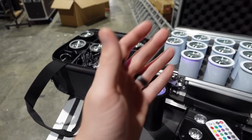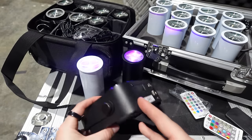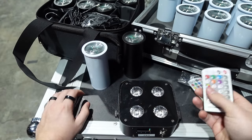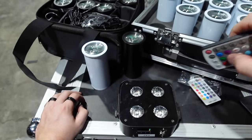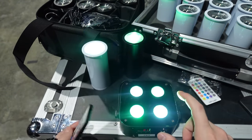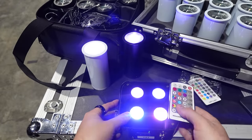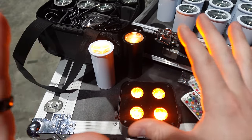To pair the Chroma Cannons with the IR4s in master/slave mode: turn on your IR4, make sure all Chroma Cannons are set to slave, and use the IR4's IR remote to control everything at once. Hit amber and everything goes amber; hit sound-active mode and the IR4 becomes the master controlling all lights in sync. Just make sure all wireless DMX frequencies are the same, and this one IR4 can control all your IR4s and Chroma Cannons together.